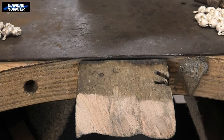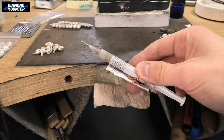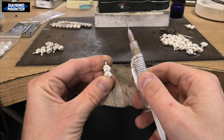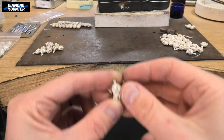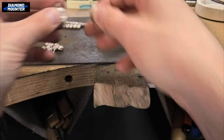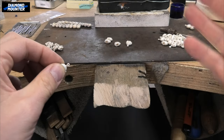I had to draw down a little wire — just wire going through links them together. I would do them in twos: put the wire in, solder it. By the way, this solder paste — I remember doing a video on solder paste where I felt like it wasn't really for me, couldn't really see the point of it. But it's so useful and so much faster. If I had to put flux on and cut off a little chip of solder it could be done, but it'd be so much slower. This doesn't need any flux — just blob a bit on and solder it up. The solder paste has been really, really good. So I soldered up two, put them over there, two more over there, then put them in the acid. Coming out of the acid I've got twos, then fours — always a bit of a production line, not doing too much of one thing in one go.